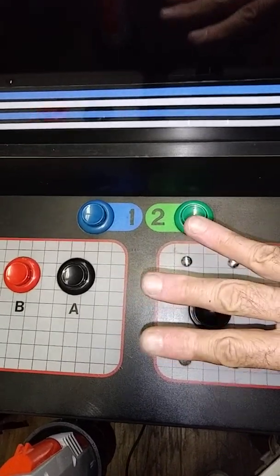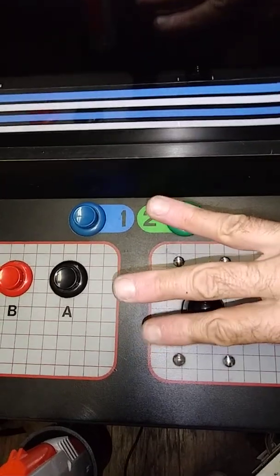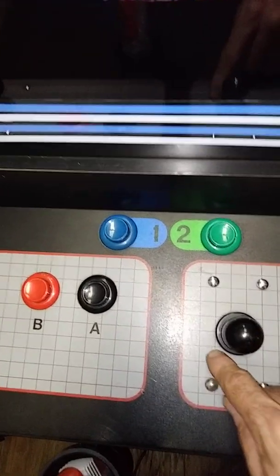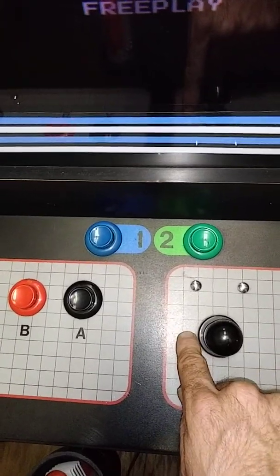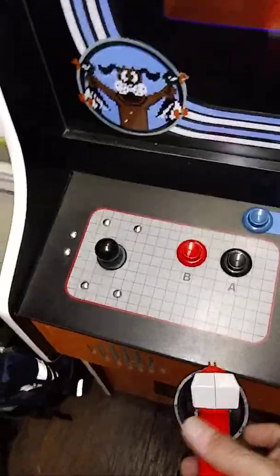What you're going to want to do is take that middle one, disconnect it, and put it onto the bottom section. What that's going to do is essentially, I don't want to say short the ground, but that's basically what it does. It shorts the alarm system so your alarm doesn't sound.